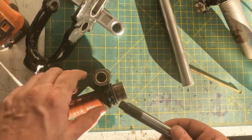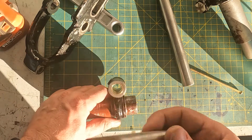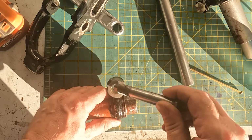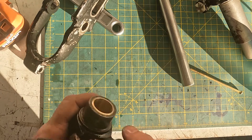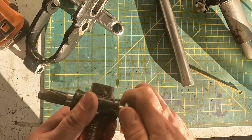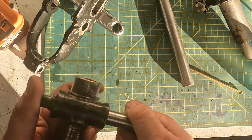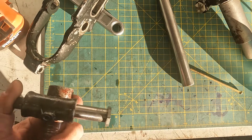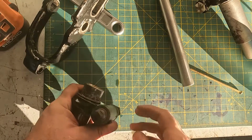So pressing in the new bushings, they are now slightly tight on dimension, so this wouldn't even go in even though it was worn. So I've worked it a bit with some oil, to the point where it does go in. There's a couple of minor tight spots, but those will find their own way, and I figure the striations on the shaft here will serve as grease capture.